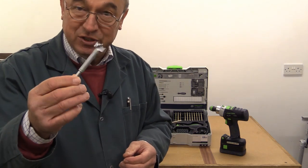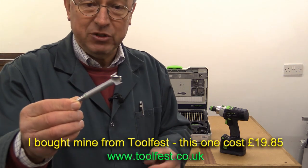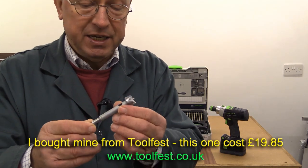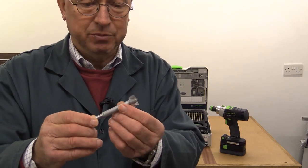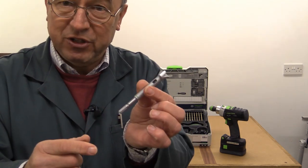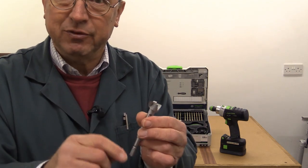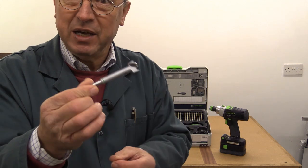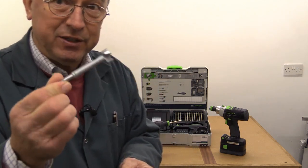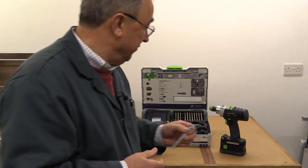Unfortunately we do have accidents. This is my Zobo bit, which costs about the same as a good quality Forstner bit. I was using it the other day and hit a screw. I was able to remove the central pin — which is what Festool expects you to do — and I was then able to sharpen it myself with a little diamond file, and it's now as good as new despite that mishap. Try doing that with any other Forstner bit and I'll guarantee you'll have trouble. Festool puts a lot of thought into everything they create.